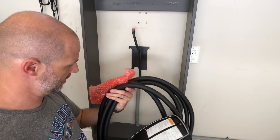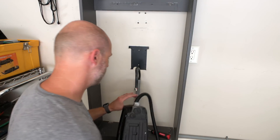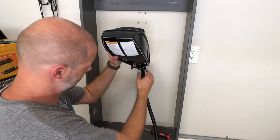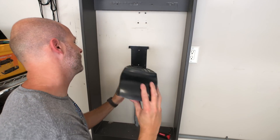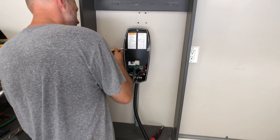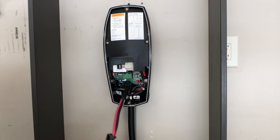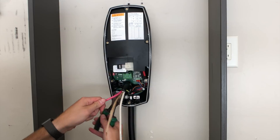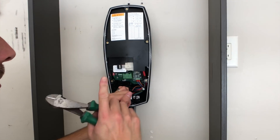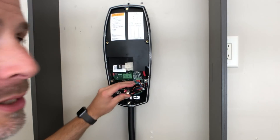Let's mount this thing up — there's a tip and a protective cover here for your protection. This is going to be the hard part, trying to feed this through without getting caught on anything. Now we're through. Tighten that side up so it's tight on the wall. Trim the wire because we don't need this much. This is six-gauge wire, by the way — that's what you need for up to 60 amps. 60 amps is the max for this wire. I got this wire on Amazon, it was actually pretty cheap. I'll try to find it and put a link. It was a lot cheaper than going to Lowe's or Home Depot.